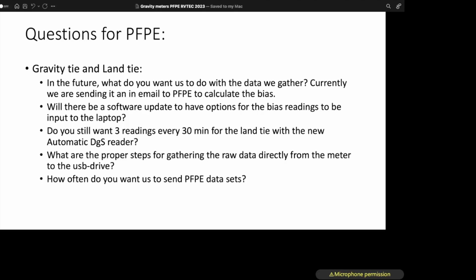I could make three points. One, I talked to that gravity expert in person when he was on sabbatical at the University of New Hampshire this summer. We talked through it, and most of the questions, bias, suspicion or doubt come from unfamiliarity with this meter. It's so new. In principle, we understand if there is a manual and a mechanical drawing of the gimbal and how they work. But actual data with really specific characteristics of these meters has been unknown to the academic community.